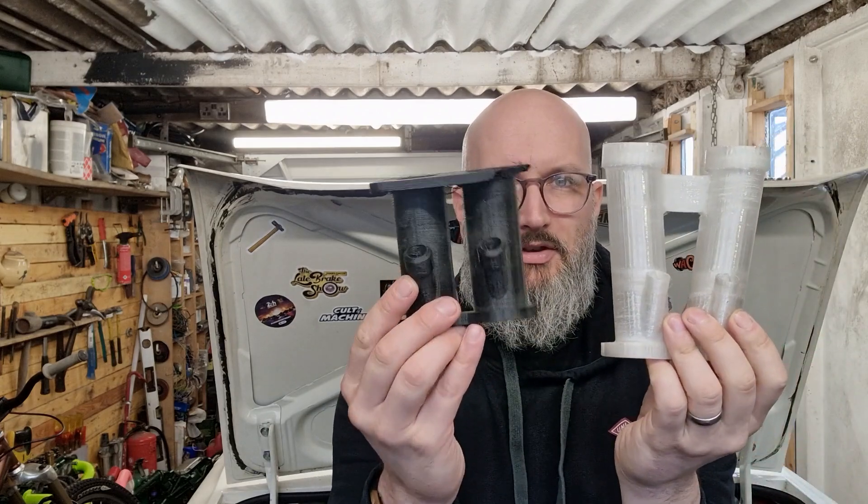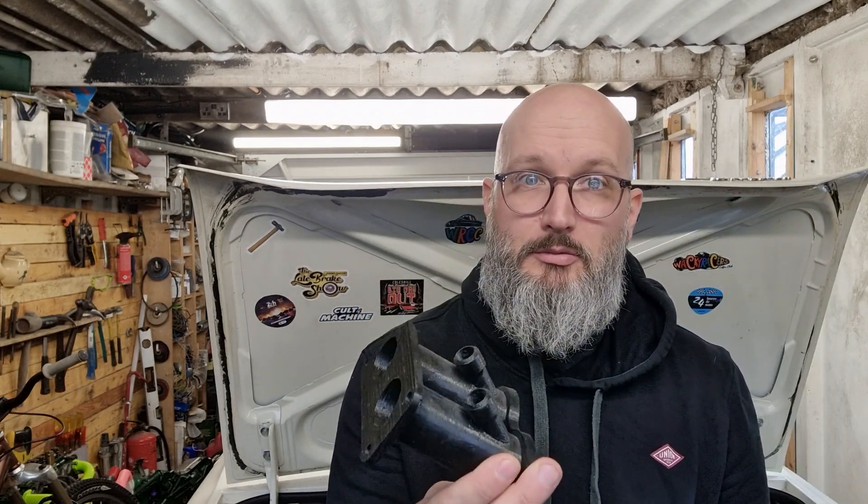There's also an old design I did not long after I bought the first printer - just wanted to try an idea out. It's a straight-leg manifold, so instead of the runners going in at an angle, these are straight. It would be a single throttle body, like a modern injection motor - one throttle body with as many injectors as you have cylinders. If we go down that route, the injector angle might be better, I could tweak it, and I won't have to worry about offsetting because it's straight so they can be in line.